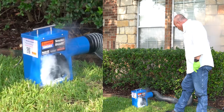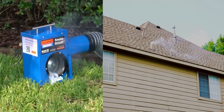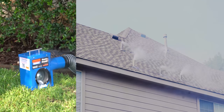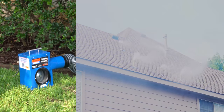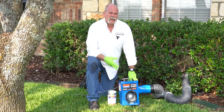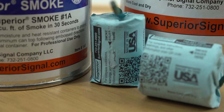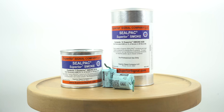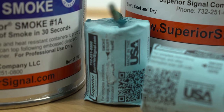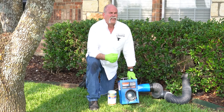As you can see, we've got the smoke going in. We've actually got the hose down in there. I'm going to walk through the house and walk over here and look and see how the vents are doing. So this Superior Model 5E is great for residential and small commercial. They make different size candles, so if you need more — now these are non-toxic candles, they're not going to cause any problems in the house — but remember, you don't want to just try to fill everything with smoke. You're trying to put enough smoke in the system to see if any leaks out anywhere. That's why, to me, this is probably the best, safest equipment for plumbers to use. They can control it. If there does appear to be a big leak, you come out and turn the system off immediately.